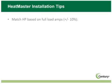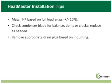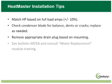When you are replacing an old motor with a Heatmaster motor, follow the normal installation steps and keep the following points in mind. Be sure to match the horsepower based on full-load amps, plus or minus 10%. Also, check the condenser blade for balance and dents or cracks. Replace the blade if necessary. You'll also need to remove the appropriate drain plug — removing the plug allows moisture to escape and increases the life of the motor.